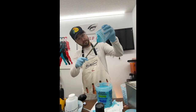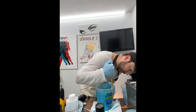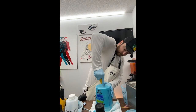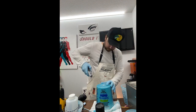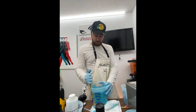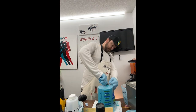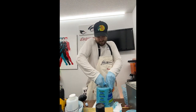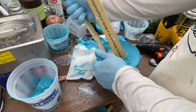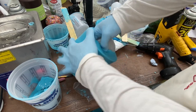45 minutes later our fast-curing silicone was ready to be demolded — and this is where I struggled. The mold release didn't seem to do anything and I couldn't get the silicone out of the bucket. I drilled a hole in the top of the bucket, then holes in the sides, and tried putting painter's sticks in to get air — nothing worked. So I ended up just cutting the bucket apart and throwing it out. Most of the time mold release does a great job, but for some reason it didn't work this time. Once the mold was out of the bucket it was time to get the duck out — but it had narrowed in on the duck's head and I actually snapped it off.